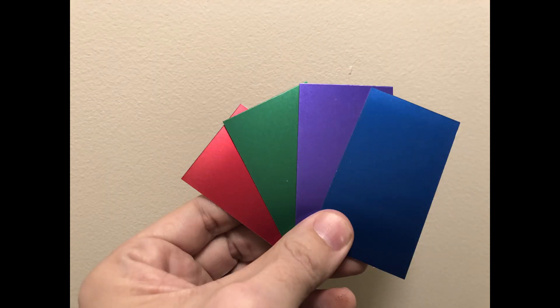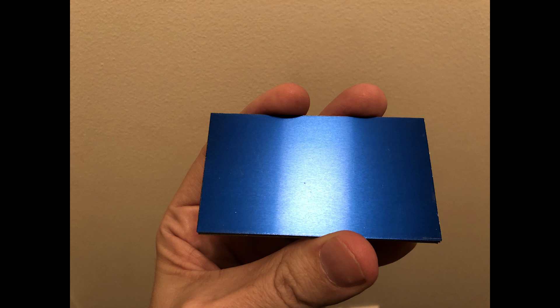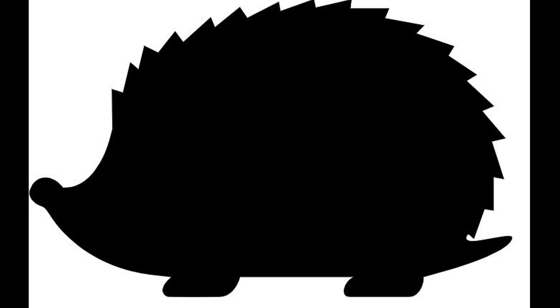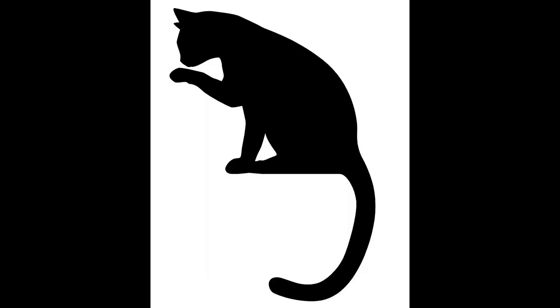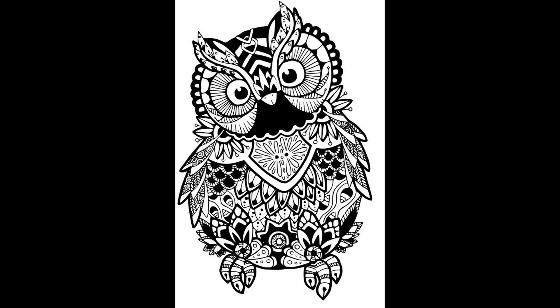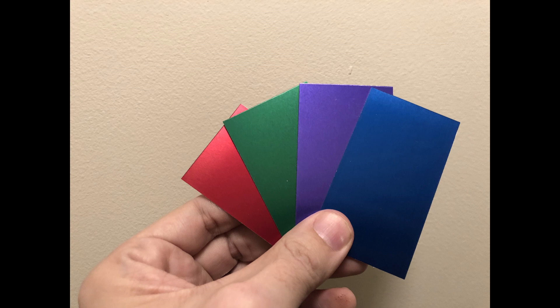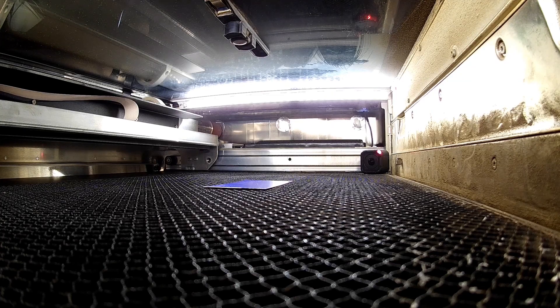I tried to enter the material thickness manually because a card we can clearly see is invisible to the measurement laser. My first mistake was guessing the thickness rather than grabbing my digital calipers. The measurement feature has made me a little lazy. There are many times a defocused laser can have some really nice results, but Aluminum isn't really one of those. That mistake will be in the bloopers video along with a few others — you'll have to watch that video to see them all. That does get me set up to start testing these burns and giving you some results.